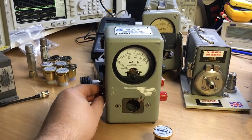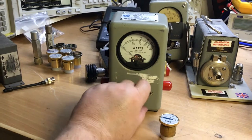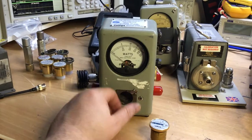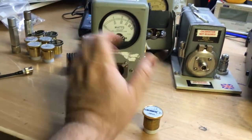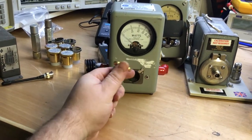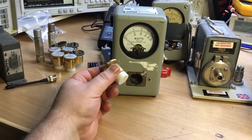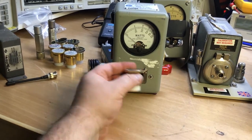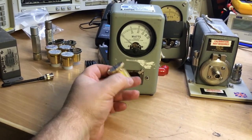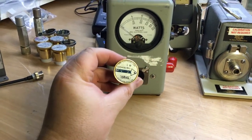It's a very nice meter, been around many decades. I do prefer the Telewave though, because at least you've got a power selection switch and forward/reflect switching, and it's calibrated from DC up to 1 GHz without needing all these pods. The Bird 43 is probably more accurate because of these inserts and specific power ranges, which gives it an edge over the Telewave, but generally the Telewave is good enough.